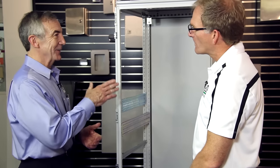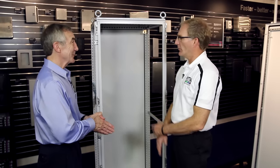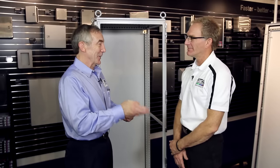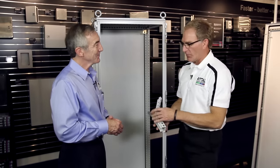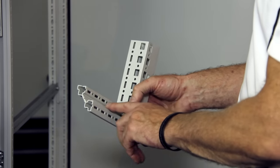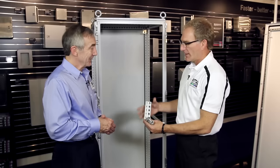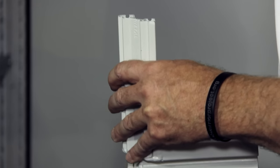Is there a limit to how much the cabinet can hold? We have tested the cabinet to over 3,000 pounds of load in just the frame — without any of the other panels on the outside, just what the frame alone will support. One of the unique things Rittal does is roll-form steel. The TS-8 vertical profile has been folded 16 times and laser welded down the middle. When you do that, you create a closed channel, and the closed channel affords incredible strength in a lightweight profile. This is the frame structure of a TS-8 that gives us those extremely strong vertical profiles.